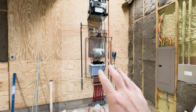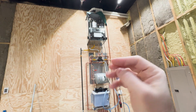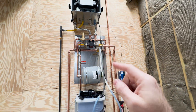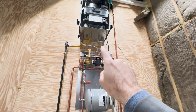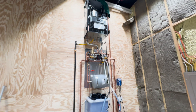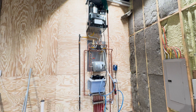The biggest thing we need to figure out here is how to waste as little water-glycol as possible when pulling the boiler off the wall. You can see the condensate hose has been slowly dripping and filling up. You can see the blue where the condensate hose connects up there, and there's still some fluid in the boiler, so we need to get as much of this out as possible.